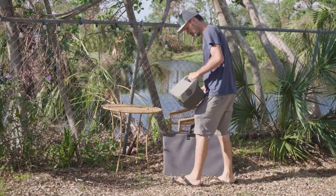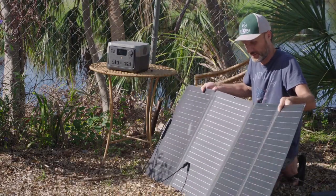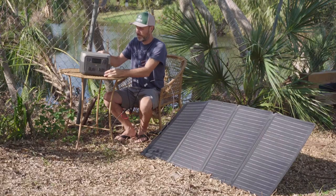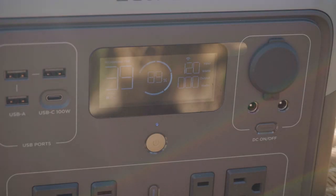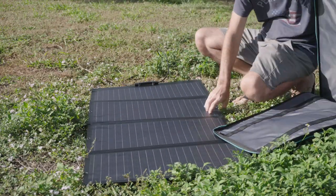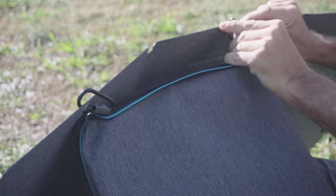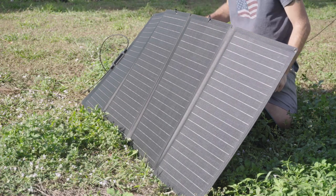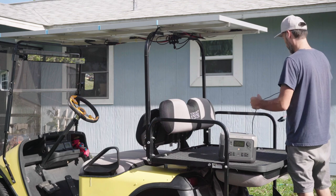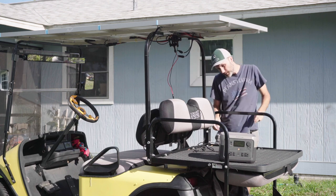This is called a solar generator because it will work with most solar panels. This is how I was able to keep the battery charged whenever we lost power in our house during a hurricane. Using the 160 watt portable solar panel I also got from EcoFlow, I would consistently get around 120 watts of power on a sunny day, meaning it takes just over four hours to fully charge the River 2 Max using the solar panel. This panel comes with a carrying bag that also acts as a stand so you can position it to face the sun at the right angle. The EcoFlow River 2 Max can charge even faster using solar panels up to 220 watts at 11 to 50 volts and 13 amps. When I used it with my DIY solar golf cart, I was able to fully charge this battery using the sun in just two and a half hours.